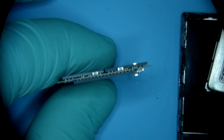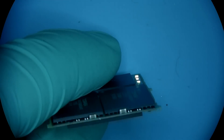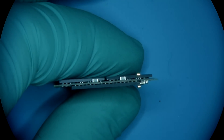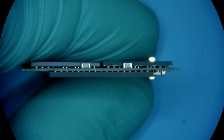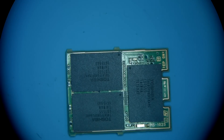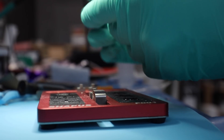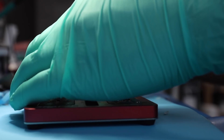So if it's hanging up, I had a suspicion that maybe one of the chips is disconnected. Through the interface itself I could see that it was bent a little bit. Now once I got it out of the case, this picture became a bit more obvious. If you look closely, this board is a little bit warped. Over there you can see that pads started to get pulled. Those exterior pads are for alignment, structural support, and extra hold to the board — but if you see them starting to separate, that's a good time to check for the vital signs.